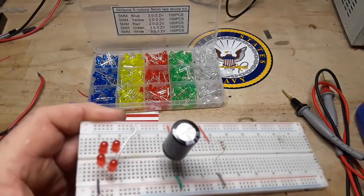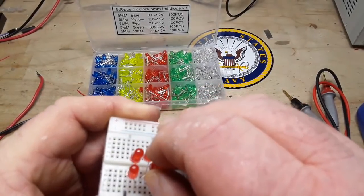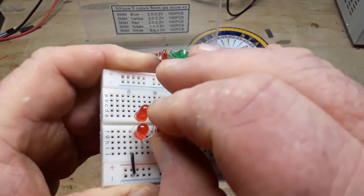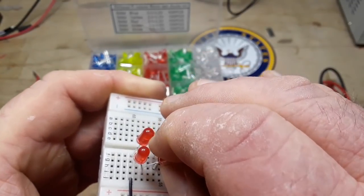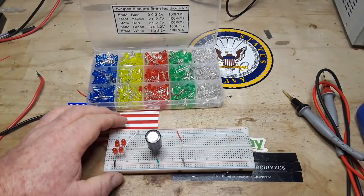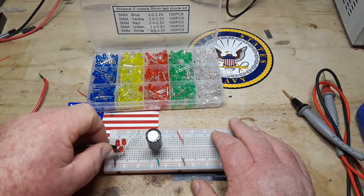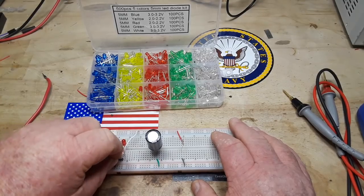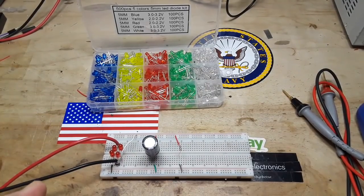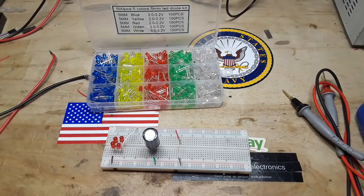I've got to adjust something here — this one needs to come up so I have room to plug in the AC. Alright, we'll hook up our AC, but I'm not going to plug that in yet. For the simple reason that they're just going to blow. What we need is some current limiting. Somewhere over here in Paul's great pile of stuff, we've got some resistors. Let's use a couple of 1K resistors for current limiting.